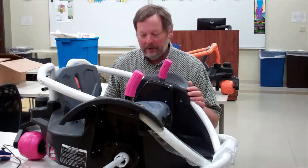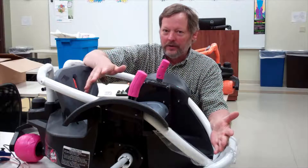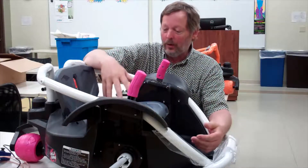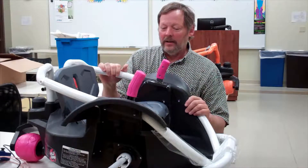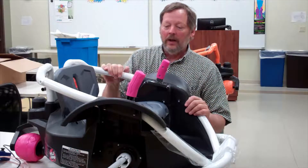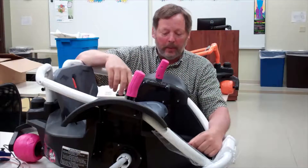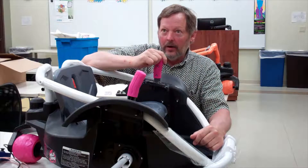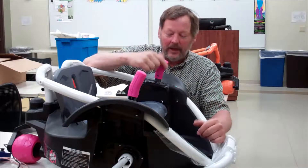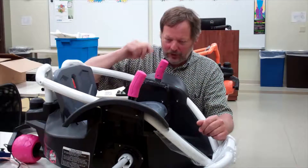As a general rule, before you adapt anything, make sure it works. You're modifying so much that sometimes when things don't work the way you expect, you need to know: is it a mistake you made, or did you buy a lemon to begin with? I've already taken this, charged the battery up, plugged it in, and yes, everything works. The original design comes with little joysticks — just forward and back, proportional control, Hall Effect switches which are magnetically coupled so there are no switches to wear out. Step one: be sure it works.